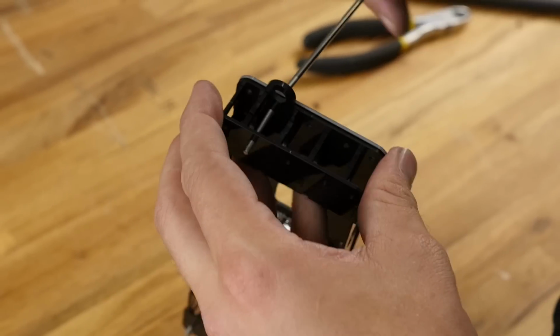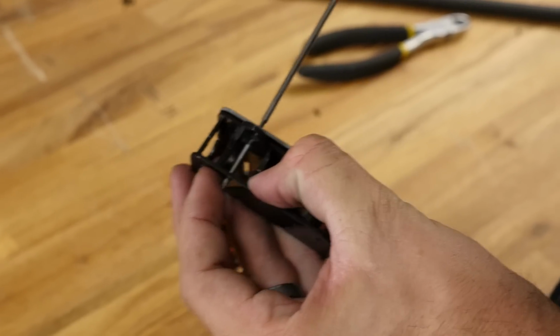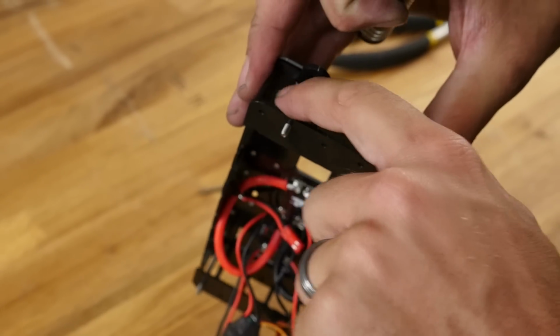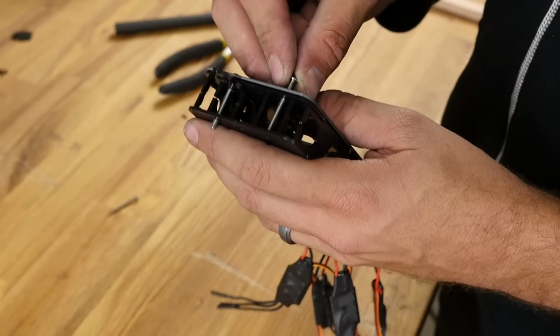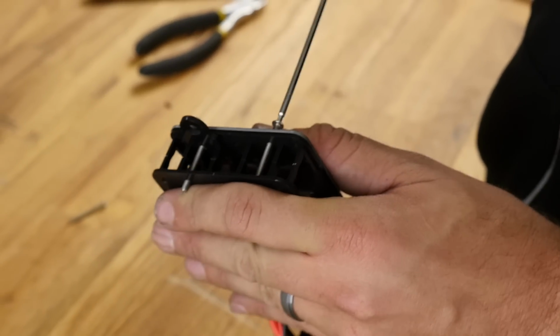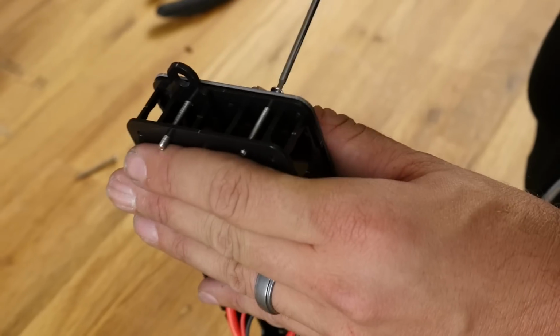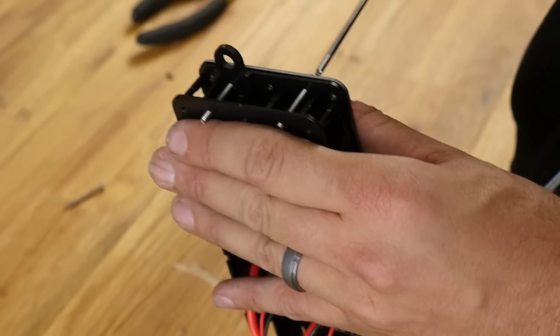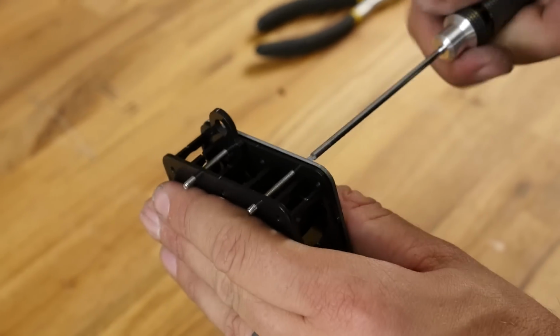Once again, you're not going to want to tighten this down too much. I'm just going to back this off a couple screws. That way this isn't pinching down too tight. Last screw, I'm going to mirror this. Now you think that you'd really have to cinch this down hard? No, the fatty Delrin does a really good job gripping the carbon fiber tube, and I don't want it so hard that it's putting stress on the pieces. I only want them to grip, not try to crush.